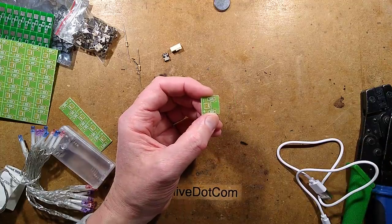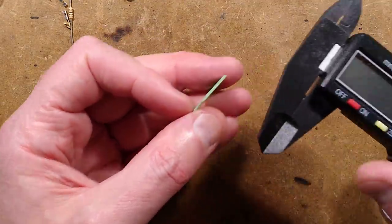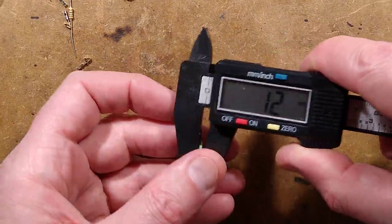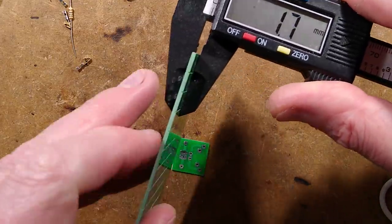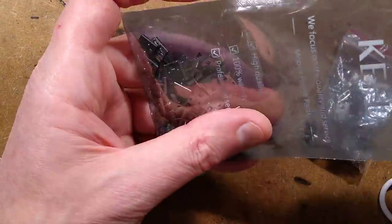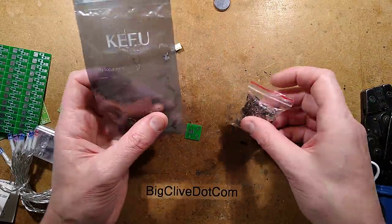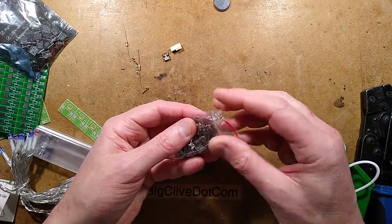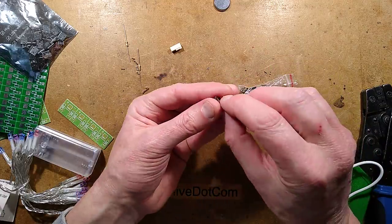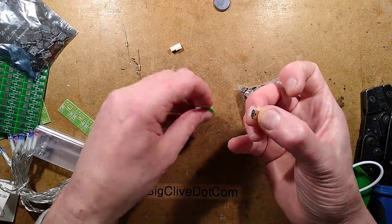This circuit board has two 10-ohm resistors, an output connector, and a little micro USB connector. I went for thinner 1.2mm board material instead of the usual 1.6mm, because the little connectors from AliExpress and eBay can have very variable pin lengths. I designed it to accommodate the shortest connector I had. These micro USB connectors have just two pins at the back, which makes them much easier to solder than surface-mount ones — they go through-hole and can be soldered easily.